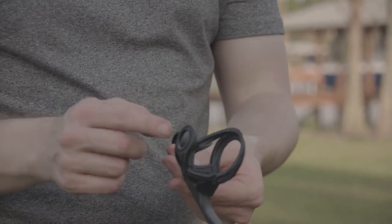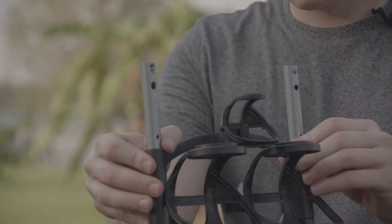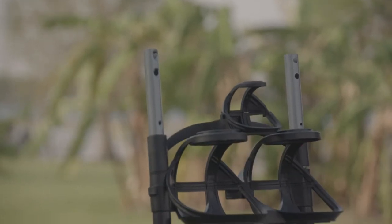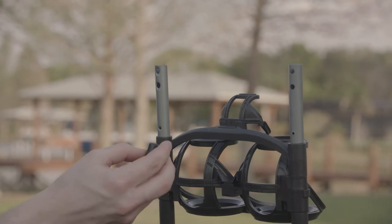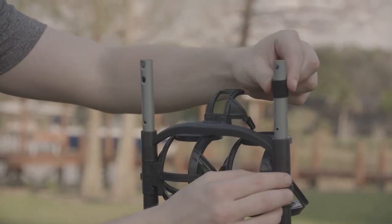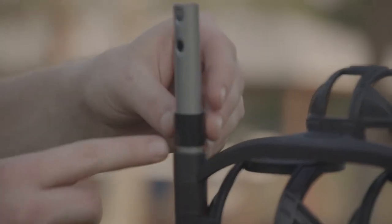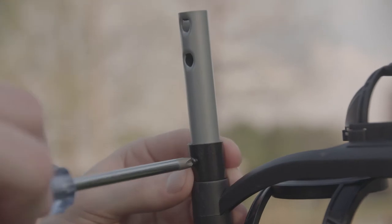Just like the ball holders, you have a small hole at the top and a large hole at the bottom. Now that that is set up, we can go ahead and slide it on top of the poles. Once that is done, we will take our small spacers with the holes and attach them to the poles. We will line up the hole on the small spacer with the one on the pole. Once those are on, we will secure them with small screws.